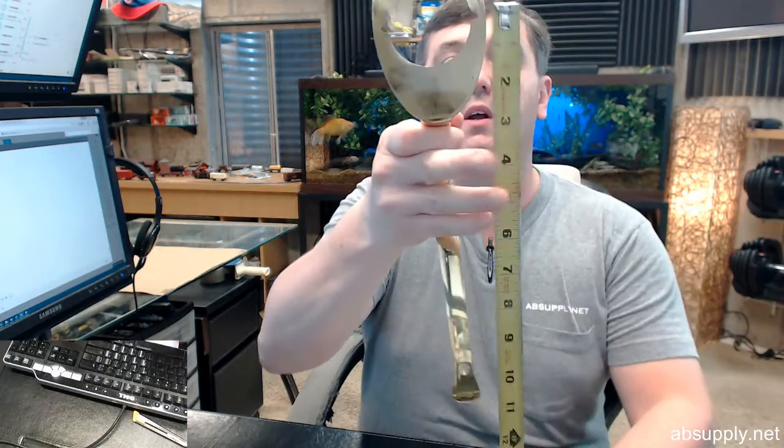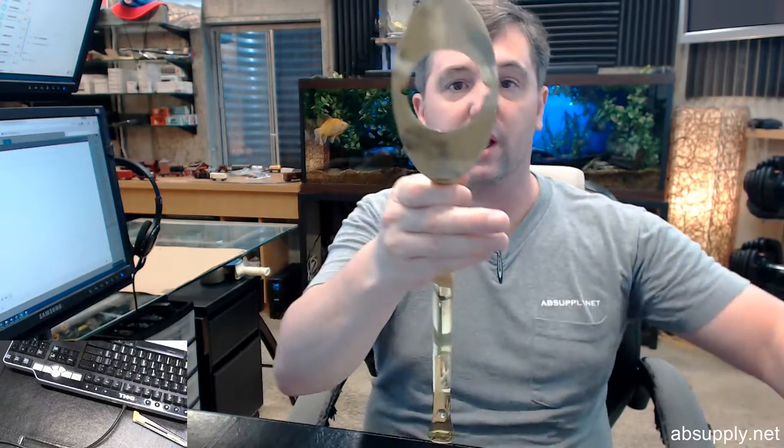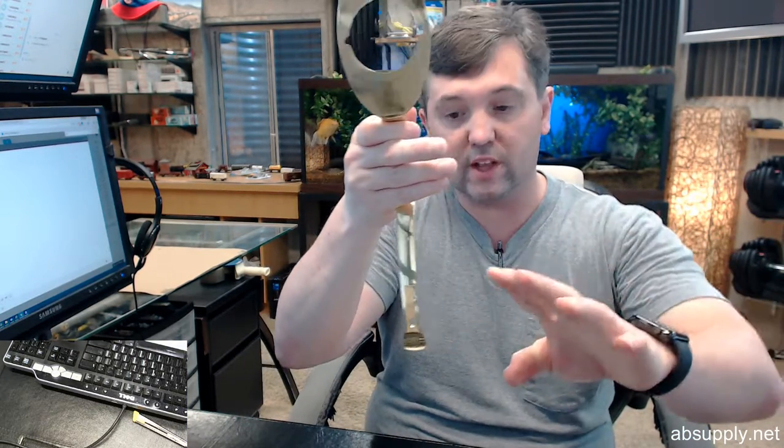Pretty much concludes everything. The installation instructions down below this video discuss making your door more fashionable by using it. Step 1, measure the center hole where the lock set was removed. 9 1/4 inch is what they're saying from the center line of the hole to where the screw is, and I'm measuring it here, and that appears to be exactly accurate. Center line of the hole down to the center of the bottom through bolt. 9 1/4 is what they're saying. From the center line here to the center line here, so that's important.